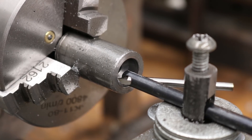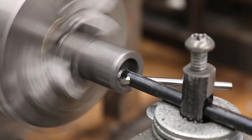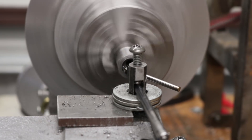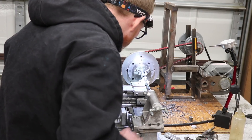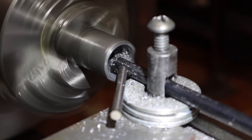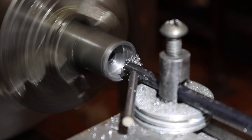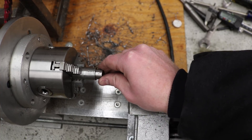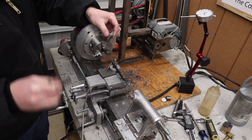One of the things that I noticed very quickly was the chatter. There was a ton of chatter with this setup, so what I tried was flipping the boring bar over and cutting on the reverse side where the material is coming up. That really had a good impact. I did overshoot the bore just a little bit, so if I make another one, I'll make it a little bit tighter.